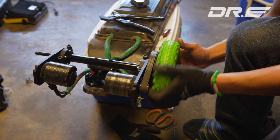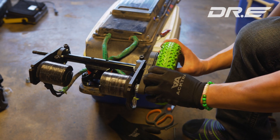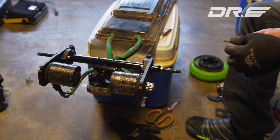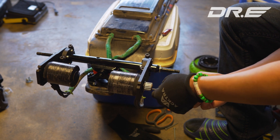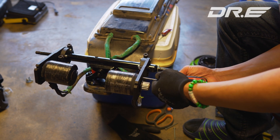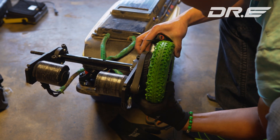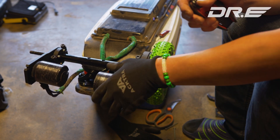Yeah, that's a little more satisfactory — see how the belt is staying right on path. Perfect alignment. I'll go ahead and take this out, push on it, and roll out the belt. It comes off real nice and easy. You may want to reapply Loctite on the motor screws, but I'm just gonna tighten it down a little bit. I think we're done with the first one. Good thing I had these belts so I don't have to wait — the motor mount sits right in the middle.